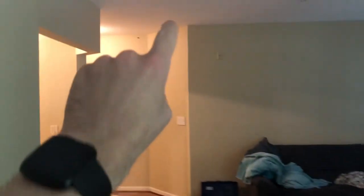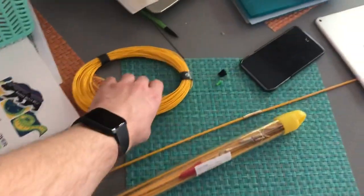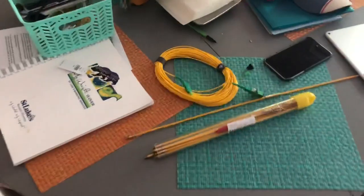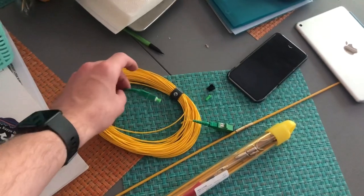This is a two-bedroom condo, and my home office is over there — that's where I want all of the network equipment to go, including the ONT. So this is all part of a bigger project where I'm running ethernet throughout this entire place. This video is specifically on the process of what you should do when running the fiber to extend it for Verizon's FiOS service to relocate the ONT. You're going to be very careful with this stuff — this is basically a very thin glass wire.